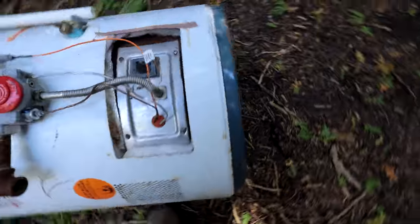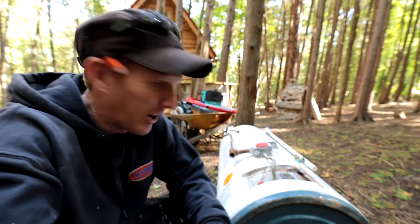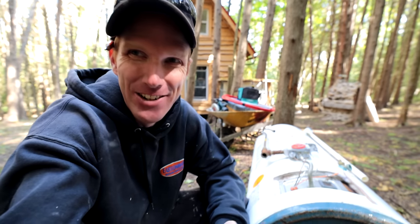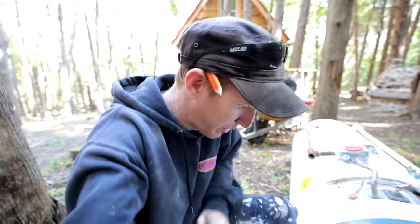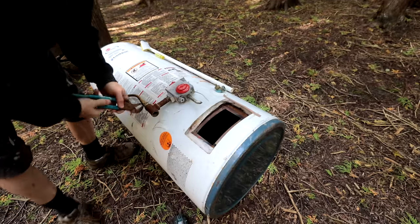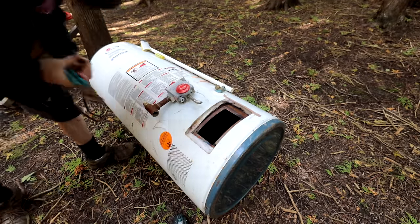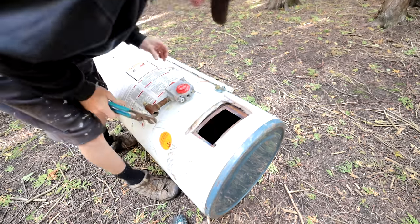This is a regular gas-fired hot water tank and I'm going to see what's inside. This looks like a firebox if I've ever seen one. I'm going to do the hot water hysterectomy - take all the guts out and see if I can make it wood fired. Hopefully it doesn't blow up, that's the main thing. Look in there - there's a firebox already built in. That's the chimney going up, the flue vent, and it comes out at the top of the hot water tank.